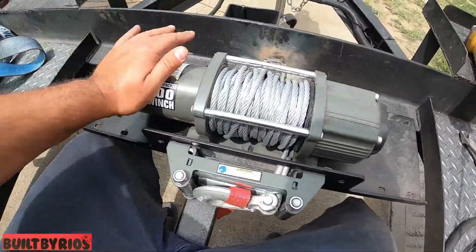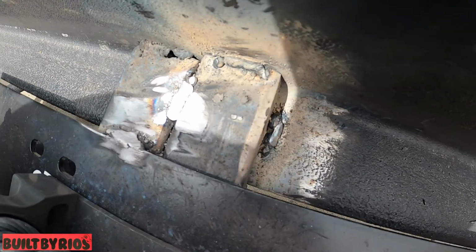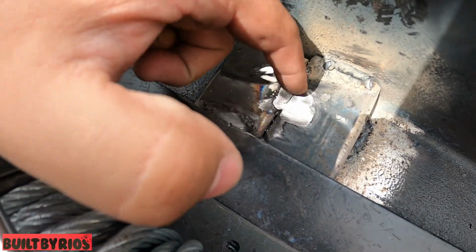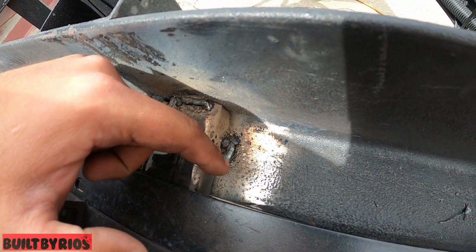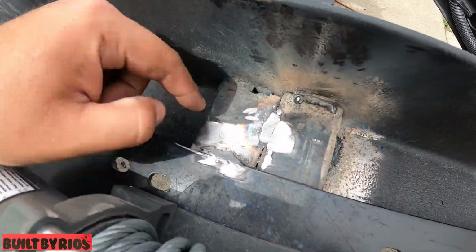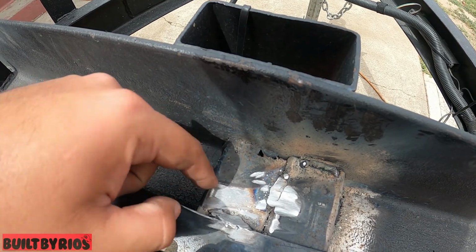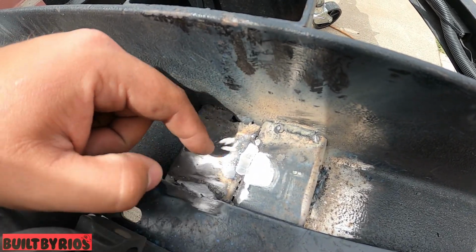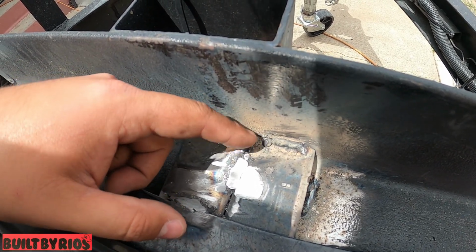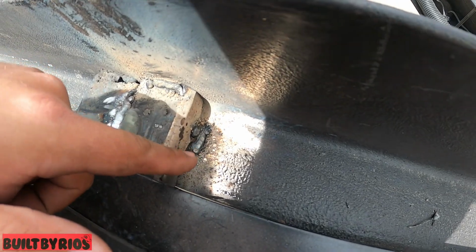All right, bringing it back. Look at my peanuts. Remember, I'm not a welder. It's just enough so they can come by and re-weld all this with the gas welder, because I have a flux welder. And it wasn't sticking to this metal. I guess it's thicker, because look, they even had trouble welding this. So I don't know, but it didn't want to stick to this one, so I had trouble. And that's why the beads are all messed up, because I'm an expert and the beads would be better than that. No, they wouldn't, but it'd be nice, smooth, liquidy instead of those peanuts.